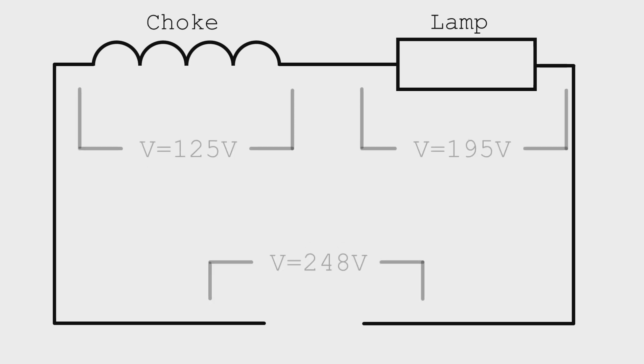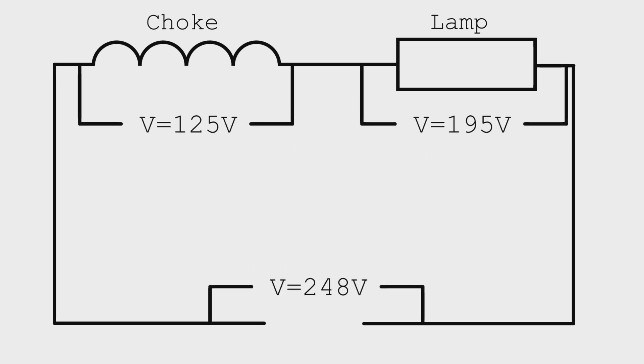Here you can see the circuit diagram for the fluorescent lamp. You can see that we've got the choke here, which we now know - when we look at the symbol for that choke - is an inductive load, and we've got the symbol representing the lamp, which is a resistive load. For the time being we're considering the fluorescent lamp without the capacitor connected, so we're just looking at the choke and the lamp connected in series with each other. We've got our two voltages and our supply voltage, but for some reason these don't seem to add up - so how can we make this make sense? Well the answer lies, the secret lies, inside the phasor diagrams.